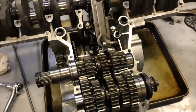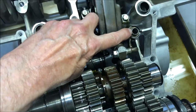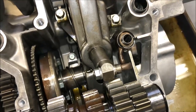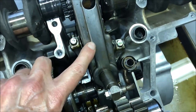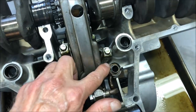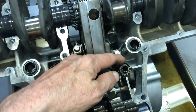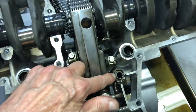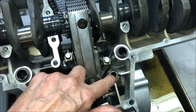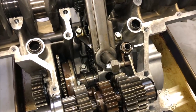The other thing is that in the video I had failed to put the oil pipe in this hole here where our little screen is. It's important to have that in there when you tighten down the primary chain tensioner, because it moves around a little bit and you have to make sure that these plastic washers are seated properly. You have to have all that together including the oil pipe, which I now have in there.